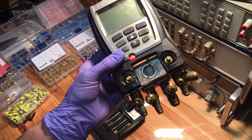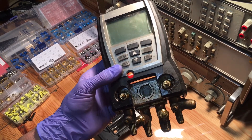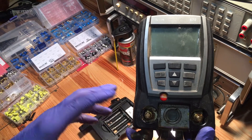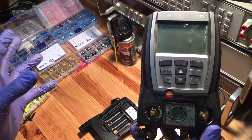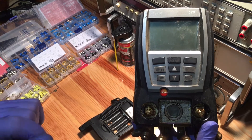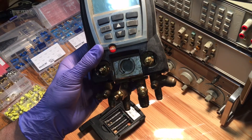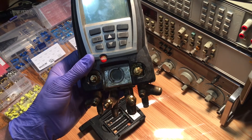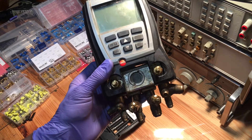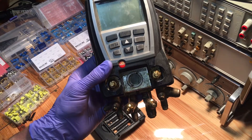If you use hoses with the little valves included with some of the hoses — the little shutoff valve in the rubber hose — those are usually your leak point. Your rubber gaskets may be your leak point. Your hoses may be your leak point. How would you like to spend 24 to 72 hours performing a perfect nitrogen test, having spent five or six days brazing up a large VRF system with 300 to 400 fittings spread throughout a building, only to think you have a leak because it was your rubber hoses, the rubber fitting, or maybe your high-vacuum-rated valve core depressor left on? Valve core depressors sometimes leak under high pressure. This is why you want to use copper only — from your nitrogen tank to your gauges, open up your gauges and take your readings.